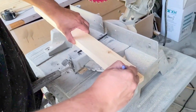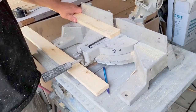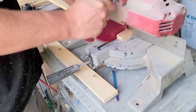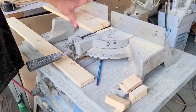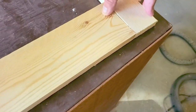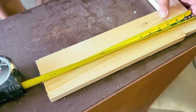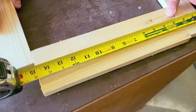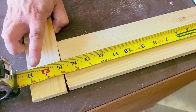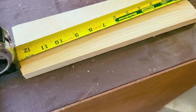Every door panel on your piece will be different sizes, so I won't put my sizes in the description because your cabinet is going to be completely different. Here's an idea of what we're working with. Always measure again to make sure you've got the right size and that it all fits together — that's the short piece for the width, and then you've got the longer pieces.